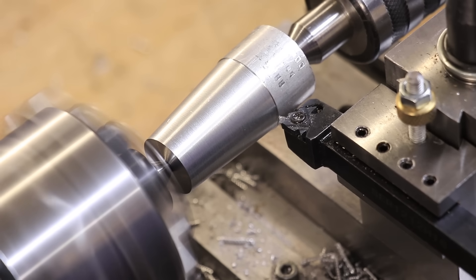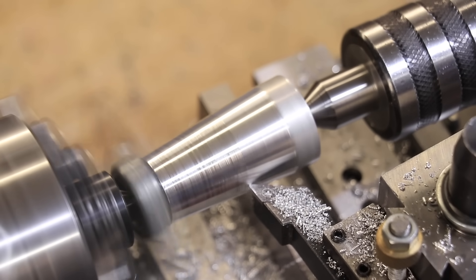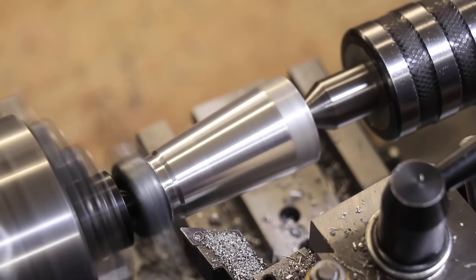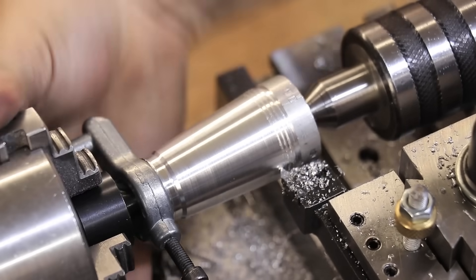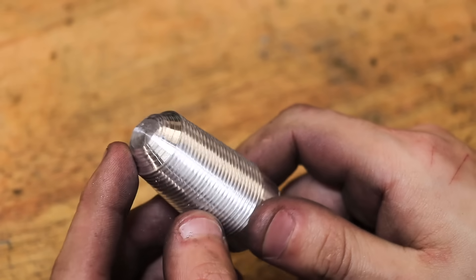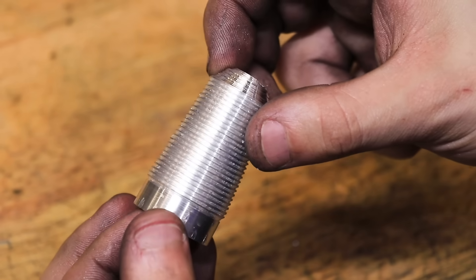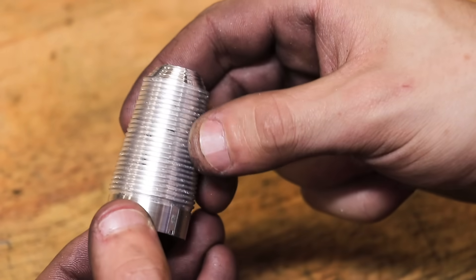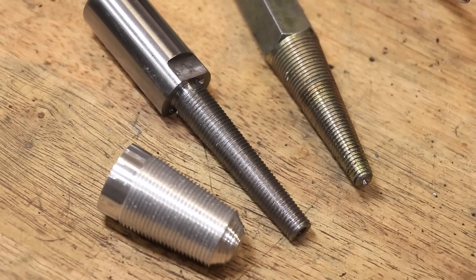Or at least I would be machining if I didn't forget to attach the lathe dog. And once the part gets cleaned up, we can see some really nicely cut tapered threads. Overall I'm really happy with this method. I don't do a lot of turning between centers, but this is really easy and I got really good results out of it. Now obviously if you have a taper turning attachment, you can skip all of this and thread using that attachment, but I don't have one and I'm really happy with how this turned out.